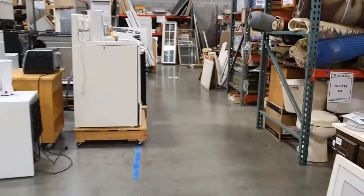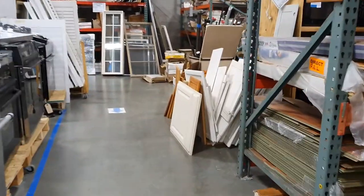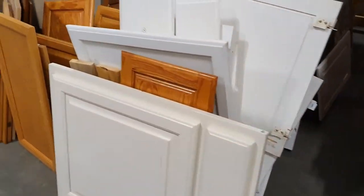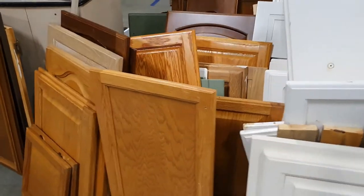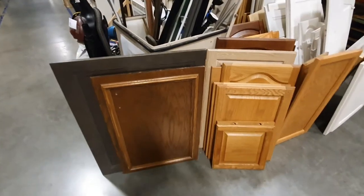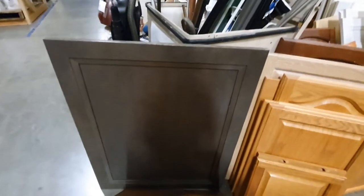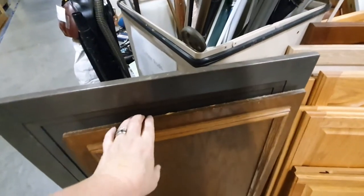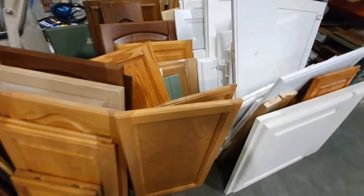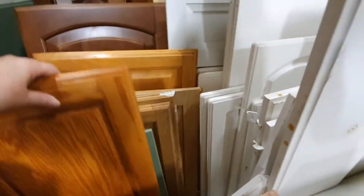The cabinet door donations come in all shapes and sizes — really small to really big, wide, large, small — whichever size works best for you. When working with kitchen cabinet doors, you want to make sure you clean them really well. Grease gets splattered around all the time in the kitchen and will sometimes come up through your paint job, so make sure you get out the Dawn and scrub any of that off.